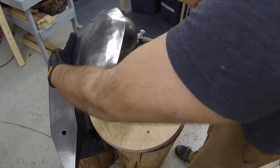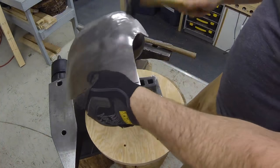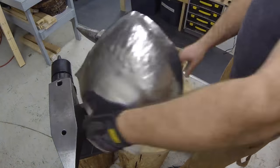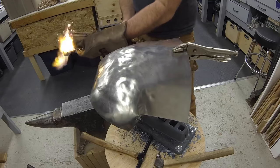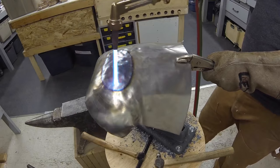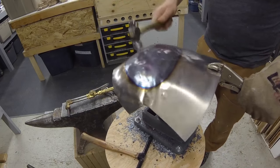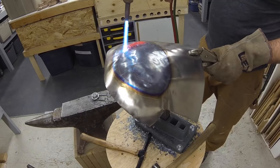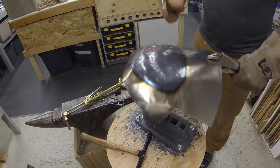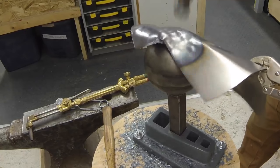It's about as far as I like to take it for stretching before I apply some heat. I'm going to quickly cold raise some of the edge just down onto the stake. You can start to see the shape of the helmet coming together already. The back of the helm is always tricky — there's that little bit of peak so you have to raise it a little bit more. Inside my shop I use an oxy propane torch with a rosebud tip. I just like to heat up that metal, anneal it, and then work it as quickly as possible while it's hot, raising it over the ball stake. I'm actually never compressing the metal directly against the stake — the center of the stake sits just off of where my hammer blows are, so you're pushing the metal down towards the stake but never squishing it between the hammer and the stake.